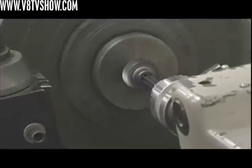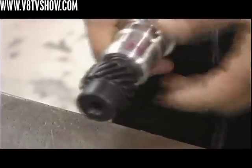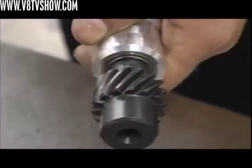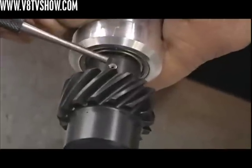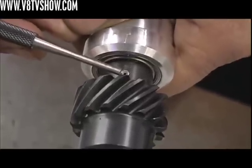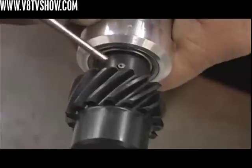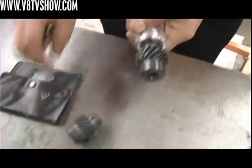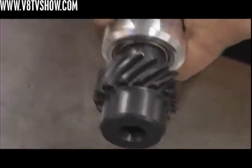Steve is going to ream that out — it only takes a minute. When putting your new gear on, there's a little trick: the roll pin hole lines up exactly with a tooth on the gear. If you rotate it 180 degrees, the roll pin lines up in the center between two teeth. You have to make sure you index this correctly when you put it on — so when you take the old gear off, put the new one on exactly the same way. Line it up with the tooth.